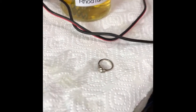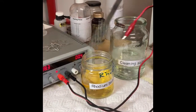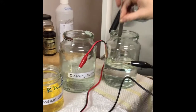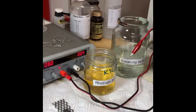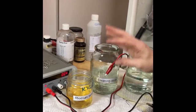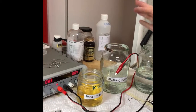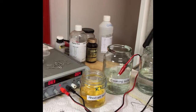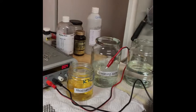Take your anode out of the rhodium solution, rinse it off in your clean water, let it air dry, and then put it back into a safe place where it's not going to get dirty. Leave your rhodium solution to air out for a little bit of time — give it five to ten minutes — then put your lid on it and put it in a dark spot so it isn't affected by UV light. And that is how easy rhodium plating is.